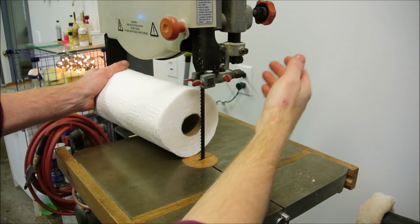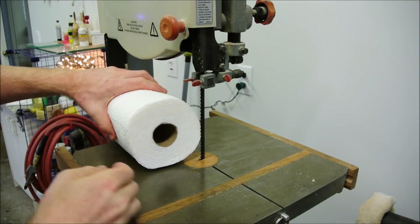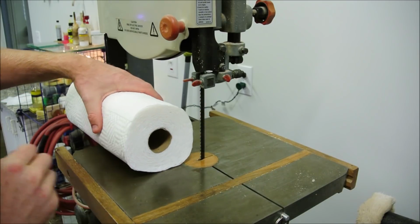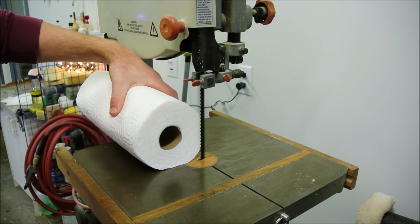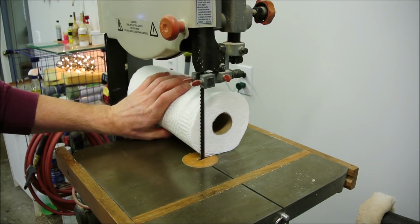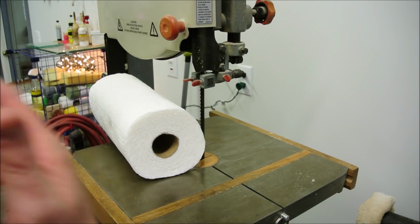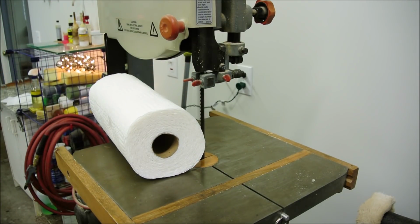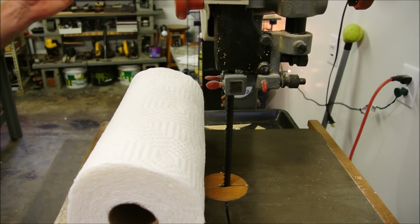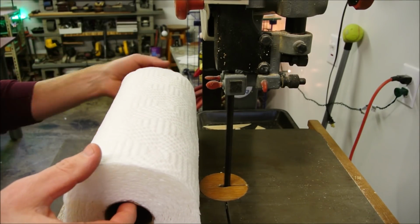So when you're cutting something on the bandsaw, you want it to be supported underneath. See how there's airspace there? That's what will tear the towel. So I make a motion like I push in and then kind of twirl the bottom, roll the bottom that way, and then I roll back this way on the way out. As you get better, you'll get less and less tear out, but it still takes tons of practice. I just guess at where center is, and surprisingly, that part's pretty easy. You'll do a good job just naturally.